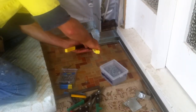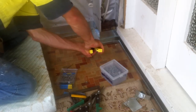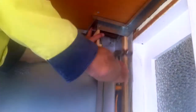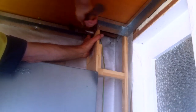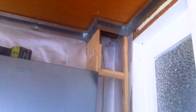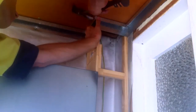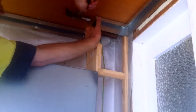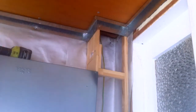The kind of corrugated metal cladding that we're using installs very quickly. Most of the time is spent getting the flashings all in place. The good thing about this galvanized metal that we're using is that once the flashings and the cladding are in place, it doesn't need to be painted, and hopefully it will last for a hundred years.